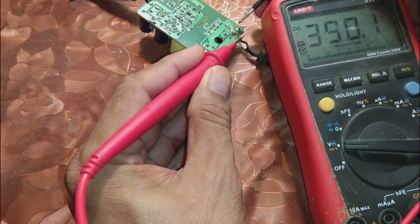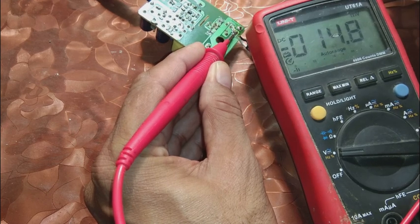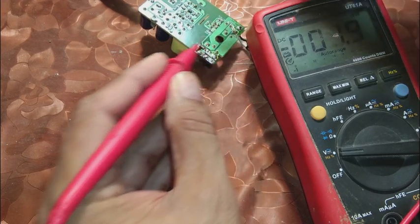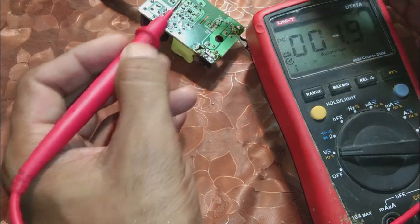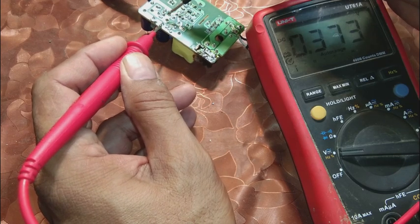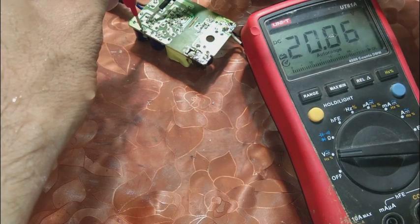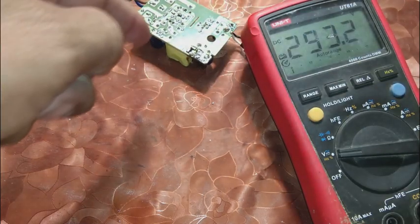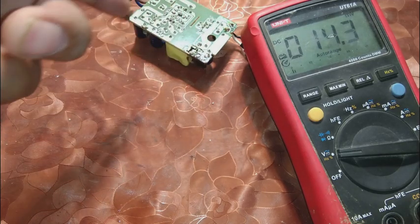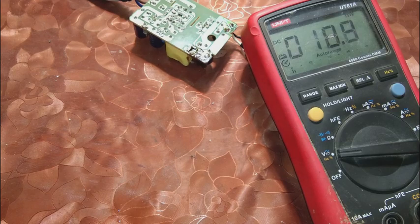I have to check the voltage over here on the output — you can see millivolts, so this millivolt reading is showing nothing, no voltage. I cannot find any voltage over here. But if I check voltage on the two large input capacitors I showed you before, I can get some high voltage — and you can see I am getting 292V DC over here on the capacitor. This tells me my connection is okay, the input side is okay, the filter is okay, the rectifier is okay, but something is happening so this power supply is not outputting — something may be wrong on the primary side or the secondary side.